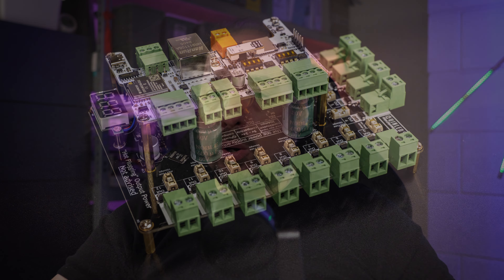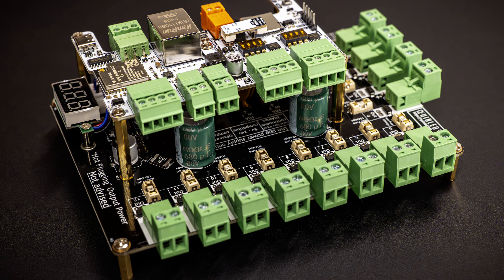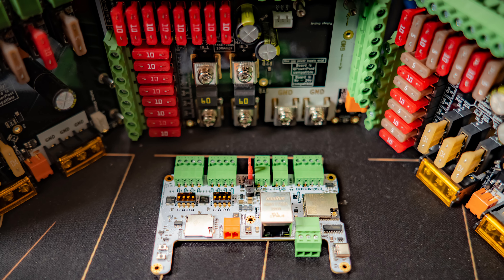In a nutshell, that intro already explained what this product is. It's a power board for the Dig Octa system that allows you to natively run 24 volt up to 48 volt addressable LEDs. No need to worry about buck converters or anything else like that. The Power 5 HV combined with a brain board takes care of all of that, and it's fully compatible with all boards in the Dig Octa system — older or new. So if you have an existing stack, you could just add it to your stack with a 48 volt PSU and have the ability to control these higher voltage addressable LEDs.